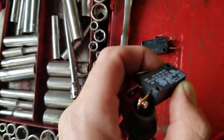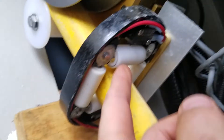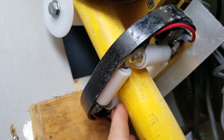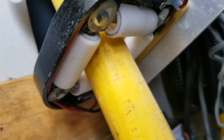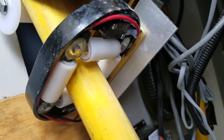It still shows that it's open. So the normally closed contact has something wrong with it internally. What we mean by wired in parallel: if one of the switches is triggered, it's not going to cause it to stop. But if both of them are triggered, the continuity is locked open and it's going to cause the unit to shut off and stop feeding the cable.